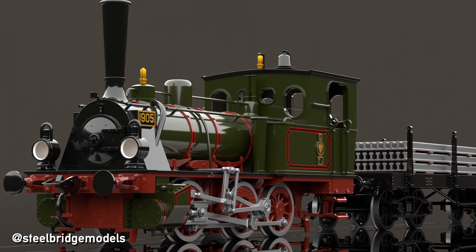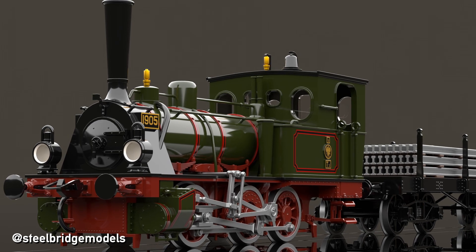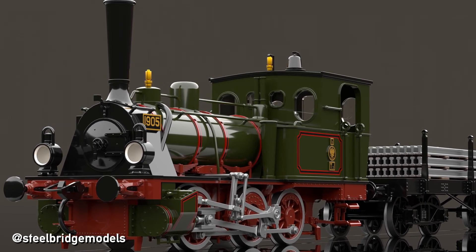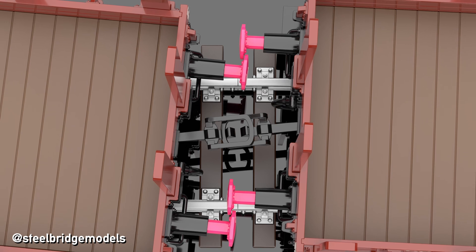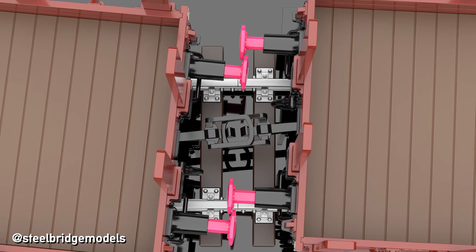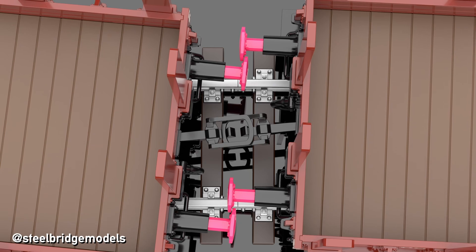There it is noted that two round buffers could not glide with a consistent pressure and have a tendency to glide off of one another. The latter is especially noteworthy, as gliding of buffers is usually only the first step towards locked buffers, which in turn are a frequent cause of derailments.